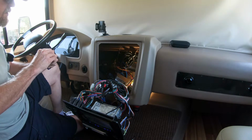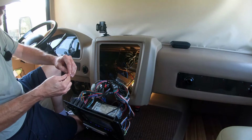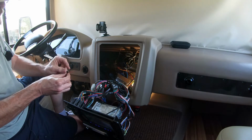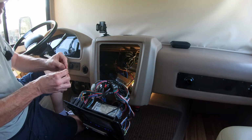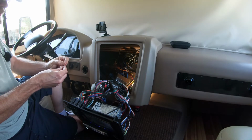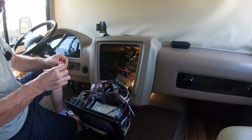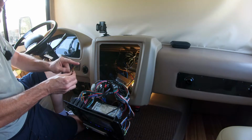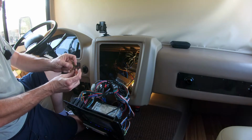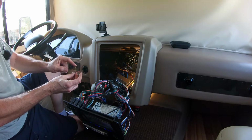Some of the insulation to see what we've got. Hold that thought. Okay, so it's only using 4, which I would expect because there's no audio circuit on these. So, going by their wiring diagram, that should be the 12 volts going to the camera, the red and the black. The yellow should be the video, and I should be able to get a video signal from the yellow and the black. That should be 1 volt peak to peak.